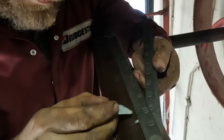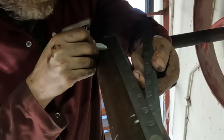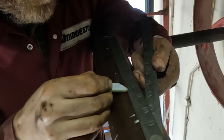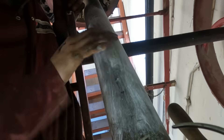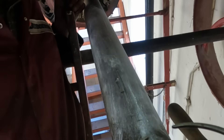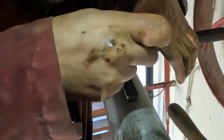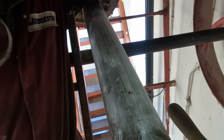The pulley needs to sit in a very specific place on the shaft, in between two beams in the ceiling. So I first mark out where the edges of the rim will be and use those marks to mark out where the hub will sit. I can then lay out where the key seat needs to be. The seat needs to be twice as long as the pulley hub is wide so the key can be driven in from one side on a level plane. I used the forging blank to mark out the seat roughly before removing the bulk of the material from the shaft with a grinder.